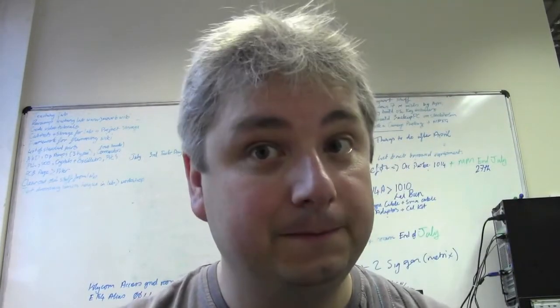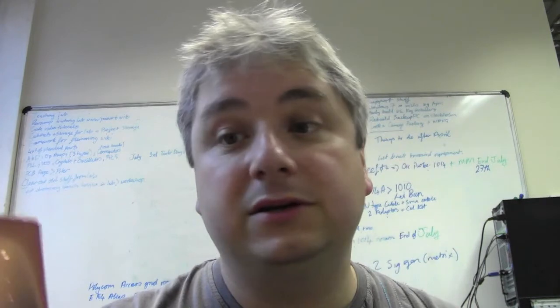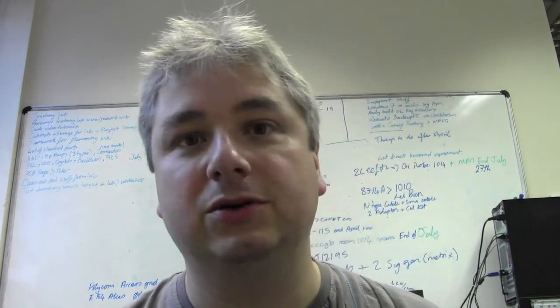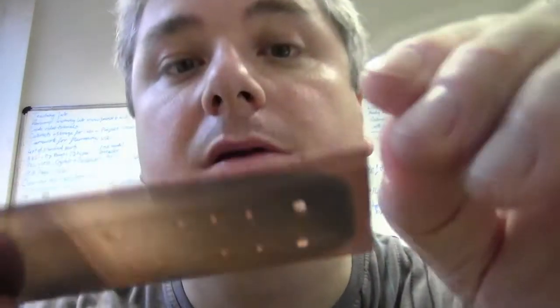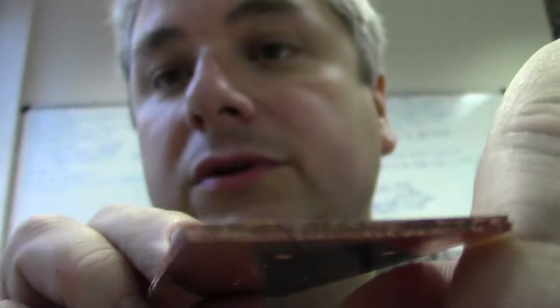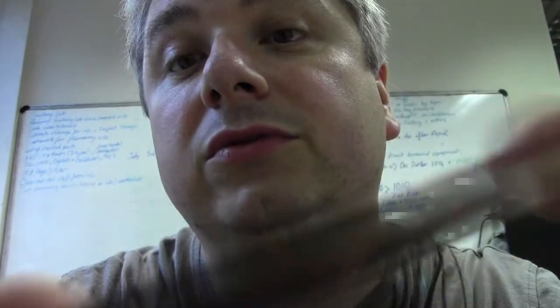So there we have it, perfectly done, quicker than what it said on the tin. If you want your holes a little bit thicker, just leave it in the tank that little bit longer, thicken it up, and there you go, it's all done. You can see it nice and clearly there, and the edge of the board is slightly missing a few bits on this side. As you can see, the other edges are done except for where I held onto the board.